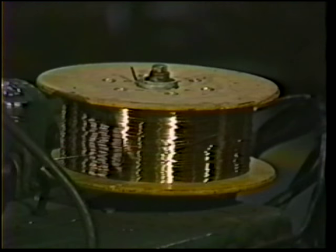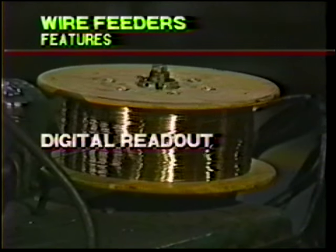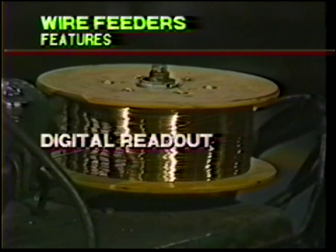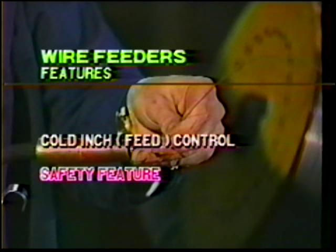Burn back control eliminates the need to keep trimming the wire for the correct stickout length. Correct stickout ensures minimum spatter at the weld starts. For consistent amperage, a digital wire feed speed readout enables the operator to obtain consistent results. An important safety feature is a cold feed control, which feeds wire through the torch without connecting the current.